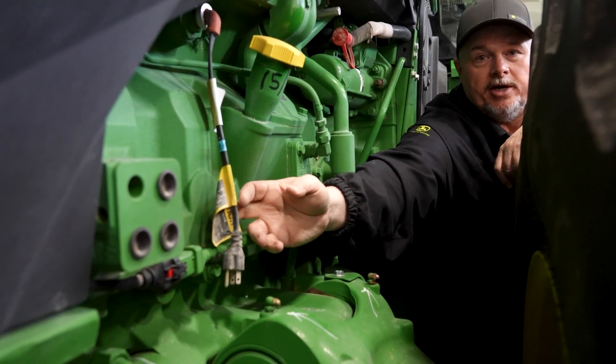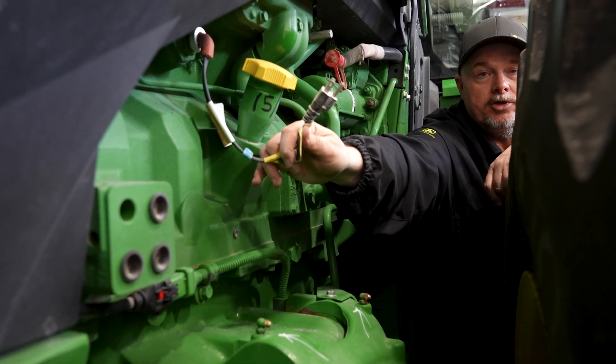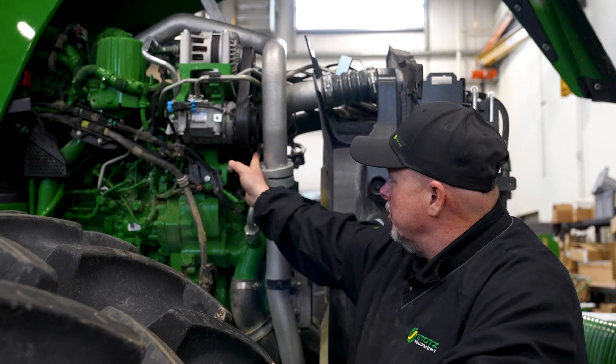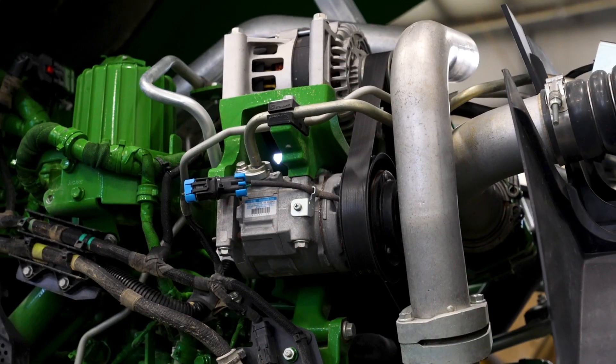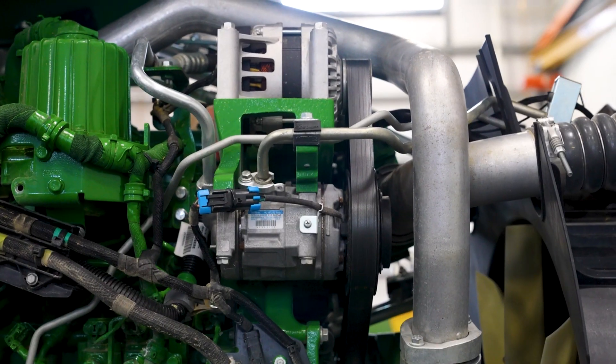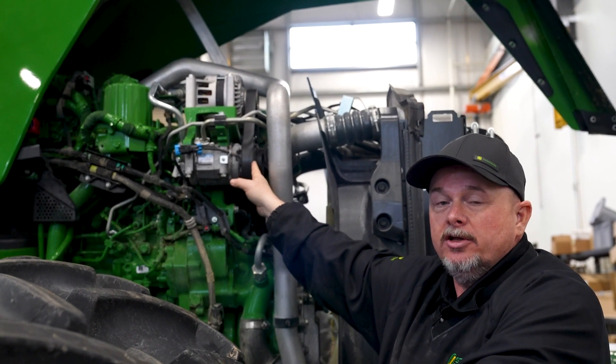On this engine there's a block heater that's accessible to your house power outlet. We removed the side panel here just to show you the belt. The belt is something you'll want to check regularly — just take a quick visual inspection. If you see any damage or imperfections, replace it, and probably check the idlers while you're doing it.